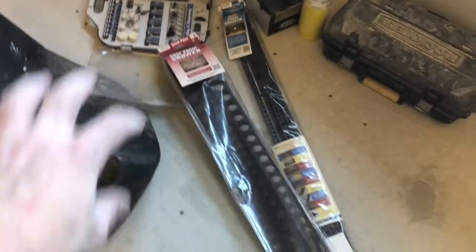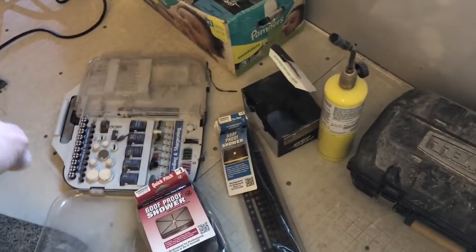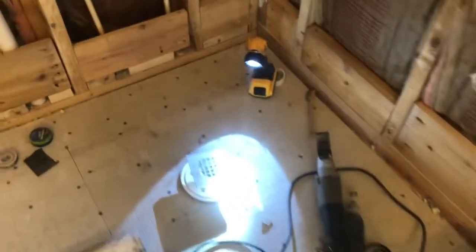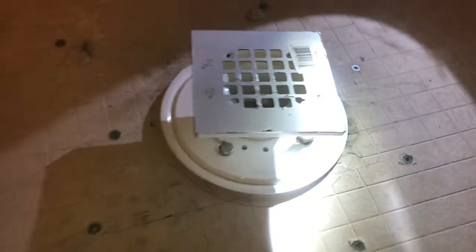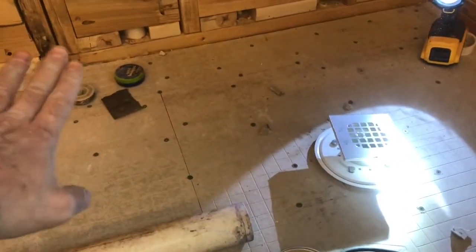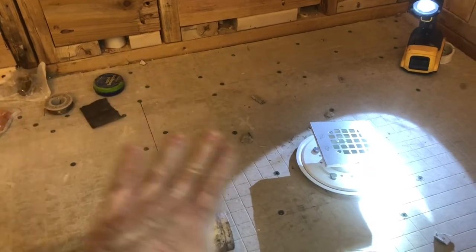Quick pitch sticks are a lot thicker, got more of an angle, and with the pre-pitch ones, you could screw them into your backer board or wood subfloor, whatever you got. But the bigger sticks, which are the quick pitch, and what pitch means is it's got a pitch on it from one end. It's a lot thicker, and it comes down. That way your water drains down.